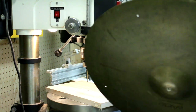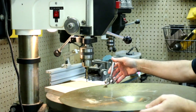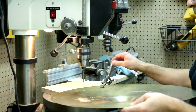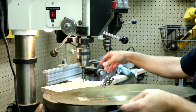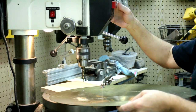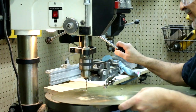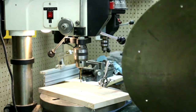One more. Now again, if you were doing this with a hand drill, you see how it rides up? The drill might skirt all over and make scratches in the cymbal. I made that mistake when I first tried this and learned pretty quickly not to do it like that. That was the last one — and there you have it.